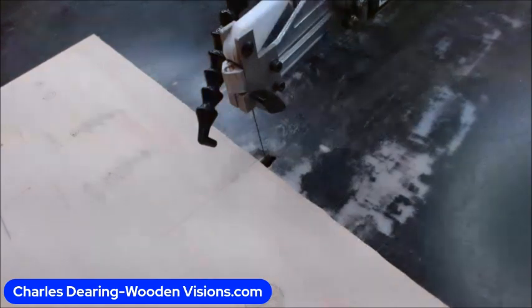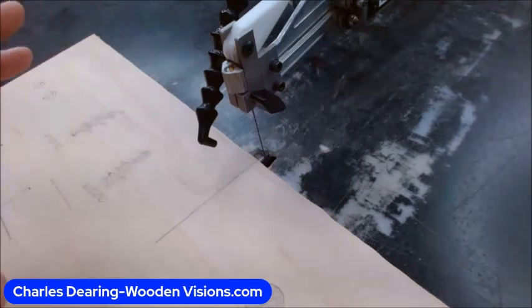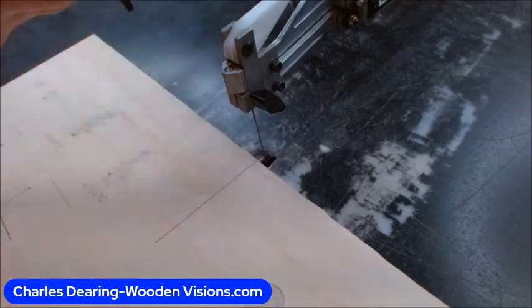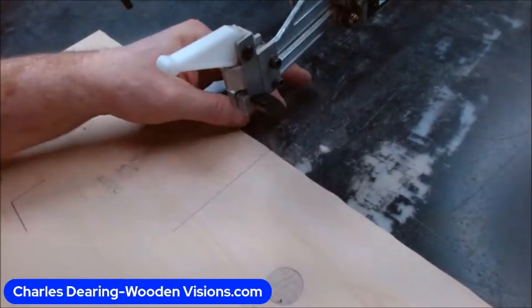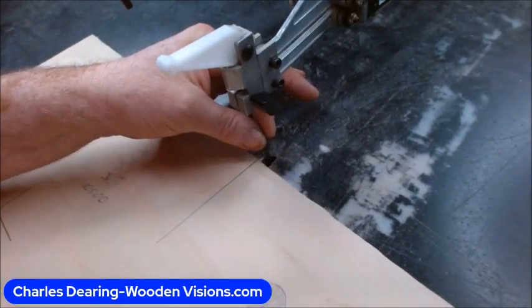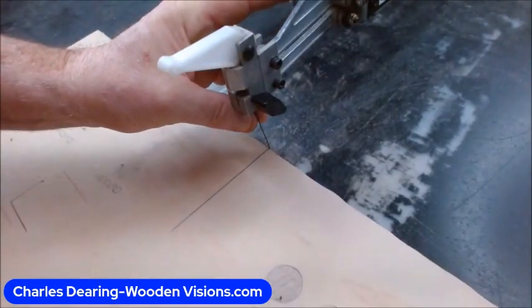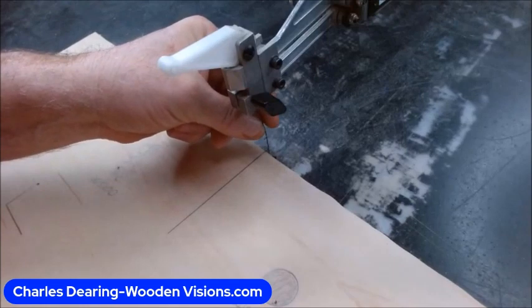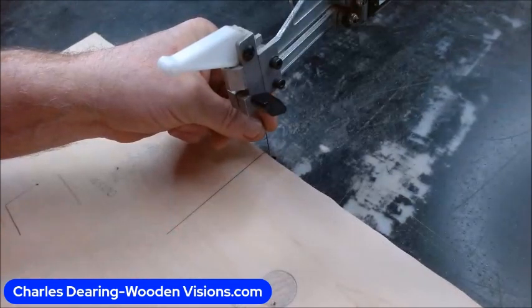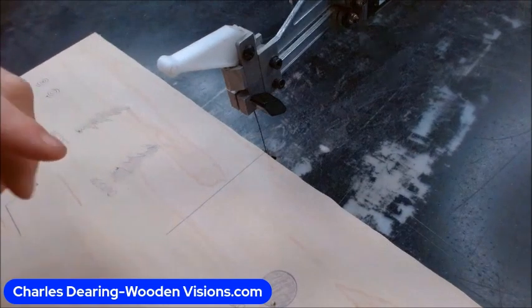When it comes to using a spiral blade, when I'm coming towards the end of a cut I will let the flex come out of that blade to finish the cut. It won't always be clear to the naked eye, but I'll take the tension off to kind of exaggerate it. As I'm pushing this piece, that blade is flexing, so when I get towards the end of this cut I stop moving the piece altogether. When I get towards the end of the cut I stop moving the piece and the flex comes out of the blade, actually finishing the cut.